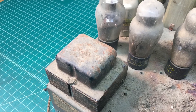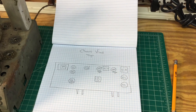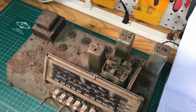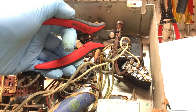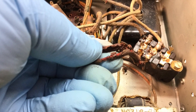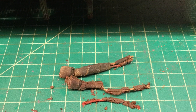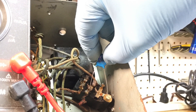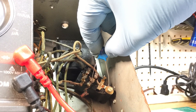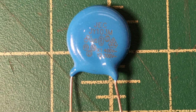One thing I always do is take a hand drawing and pull the tubes out one by one and compare that to the schematic. In this case, I think I've got at least one mismatched tube — it may be a substitute. Two of the tubes were not marked; I've got those labeled right now using painter's tape. Here you can see I'm removing or cutting that old AC cord. Just for newbies in the hobby: never fire one of these up. You can see the wires are frayed — it would be a safety issue first and foremost. Just a quick visual — you'll see the Philco blocks, and inside those encased blocks is typically a tar waxy substance with capacitors stuffed in. I've even found resistors in there as well. We'll be restuffing this with modern day safety caps.